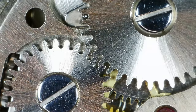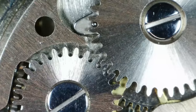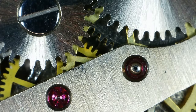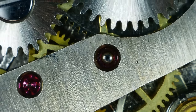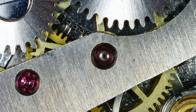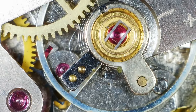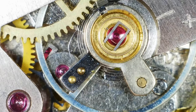So what I can first tell you is the watch is fully wound. You can see here, this is all I can turn. So let's just have a quick examination and maybe a little prod and a poke as well. Why not? So we're looking at some jewels here. Let's try and get a better light on them. And that one there looks particularly dirty, doesn't it? In fact, the whole movement looks pretty dirty. Look, I can see, is that on the balance itself? Or is that just on the regulator pin, but now it's in the hairspring.